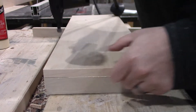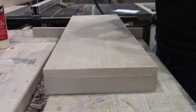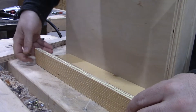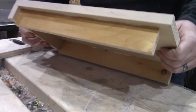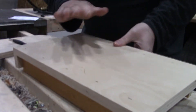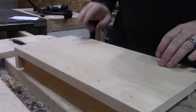Using the same birch plywood as the rest of the desk as the main portion of the shelf, I glue and staple on effectively the drawer front, followed by the drawer slide mounts on the underside, offset a half inch from the edge. I didn't bother edge banding the inside of the drawers or the shelf, other than the front facing edge on the shelf front, and the drawer slide mounts are pretty rough, but I wasn't worried about that since you're never going to see it, and if anyone does, it's going to be me, and I think it's fine.